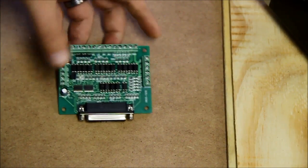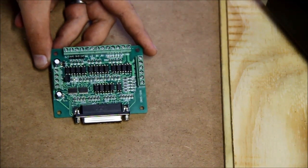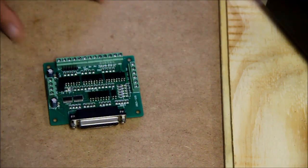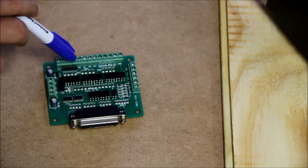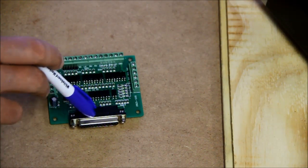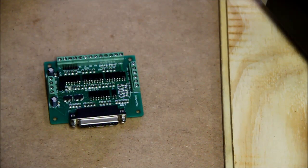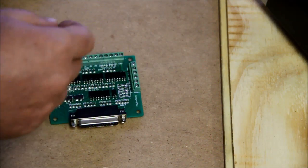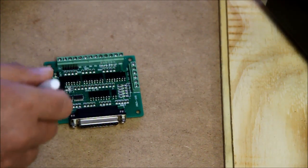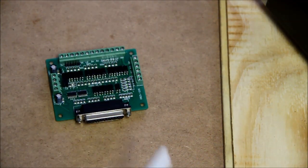Right, there we have it. The BOB stands for breakout board — that's what comes in from the computer. There's a parallel port input for the board, power that comes in over here, and all these pins relate to this parallel port. All these little caps and resistors — forgive me if I use wrong names. All of these things are optically isolated, so you don't get damage if something goes wrong when you wire it up.